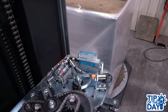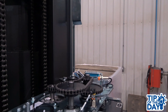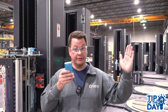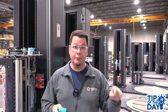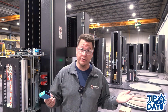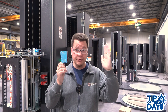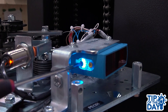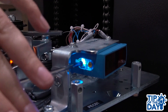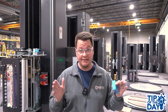Then, with the equipment being powered up, you need to set the sensing distance. This can be done by placing an object at the distance where you want the sensor to be adjusted to, and then press and hold the sensitivity dial for about two seconds. By doing so, the sensor will record the distance to the target and will use that as a sensitivity range. You should now see the corresponding blue LEDs showing your adjustment, and you can also turn the dial to fine-tune your sensing distance.